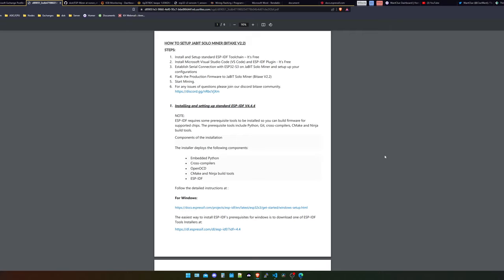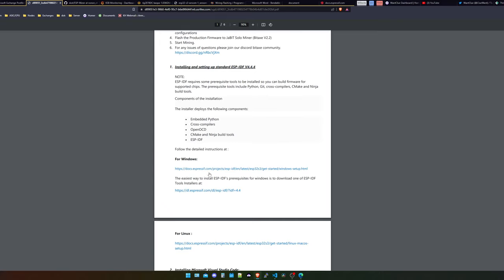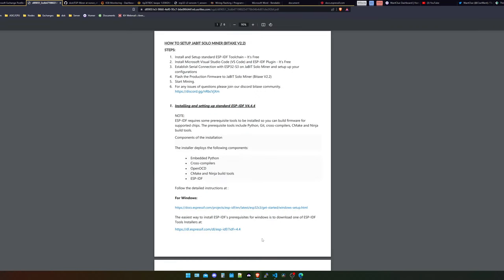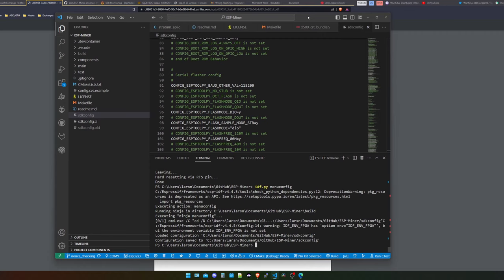So what do we need to do? The first thing we probably need to do is install the ESP-IDF v4.4.4. All you need to do — and I will put all the links in the video description — is download this. In today's video, I will just cover Windows; I will not explain how to use this on Linux. What you need to do is download the ESP-IDF. You click on the link, go to the website, and download the Windows installer. Choose the version you want — in this case, 4.4.4 — the offline installer. Just download and install it on your device. The second thing you need is Visual Studio Code. If you don't know what this is, just download and install it. It's a program where you can actually program stuff, and that's especially what we're going to do today.